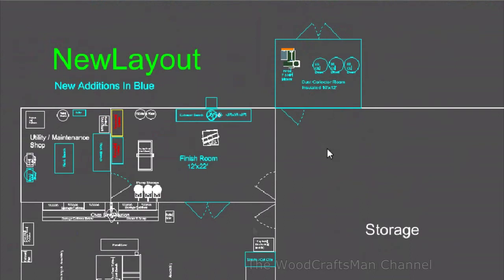So with that being said, one of the big changes that has to happen is that now I'm physically drawing air out of the shop and drawing it into this room, basically filling this room with air. I want to return that air and bring it back to the shop, so I'll have to have a return trunk line that brings air back to the shop.